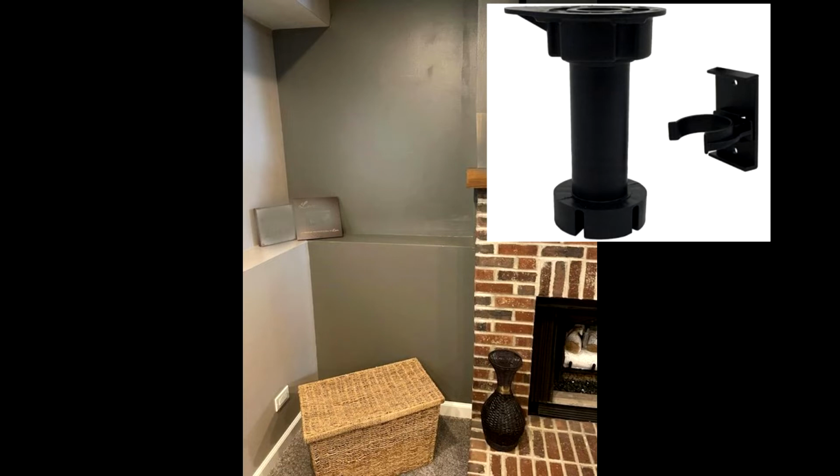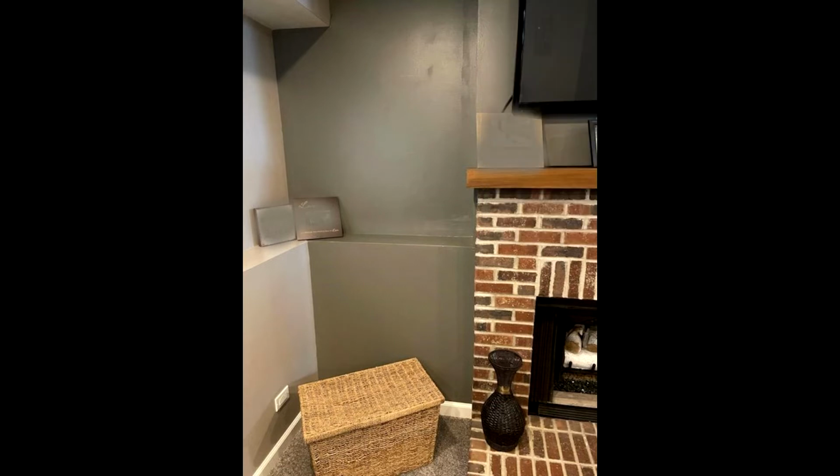And so I chose a nominal height laying out the cabinets, and then I could fine tune it with these leveling feet. Another interesting feature is they have these clips that you can actually attach your toe kick or your baseboard to, and they click onto the leg itself. I did use that feature in this build, but I had to add about 1 inch of material to that front clip to get it flush with the face frame. But I also shot nails into the face frame through the baseboard to really secure it.